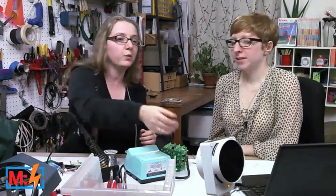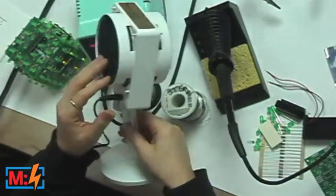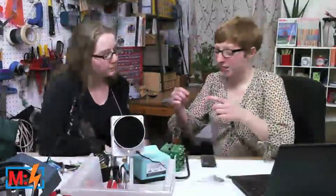Either way, some people ask whether lead fumes are more dangerous — they're both really bad for you. You don't want to inhale the fumes of either. In fact, the fumes from lead-free are actually worse because it requires a more activated flux — that's what you see as smoke. You want to get a fume extractor: a little fan with a carbon charcoal filter. If you have a window, that works really well too. I practiced blowing away from my work for a long time before I had a fume extractor.